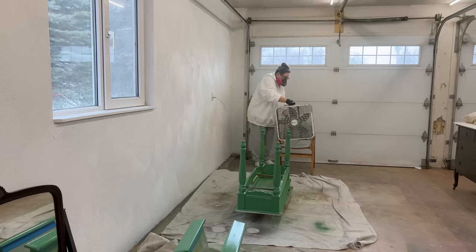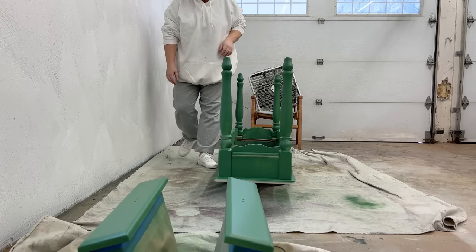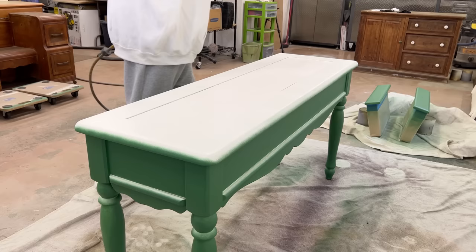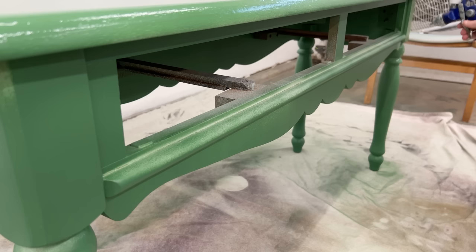Since it's winter and I have my space heater running in the corner of the garage, I propped my box fan on the other side of the room to help move the warm air around, and left this to dry for about two hours. After getting the table right-side up again I had some marks from the little roller things I had the table resting on, so I wiped those smooth with 400-grit sandpaper and then I was ready to paint the top.